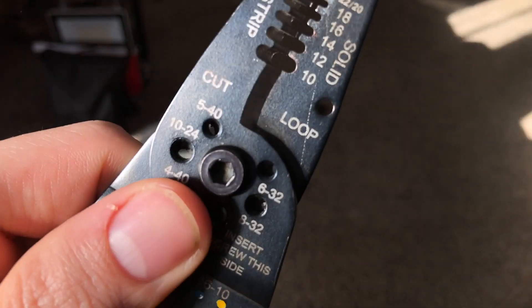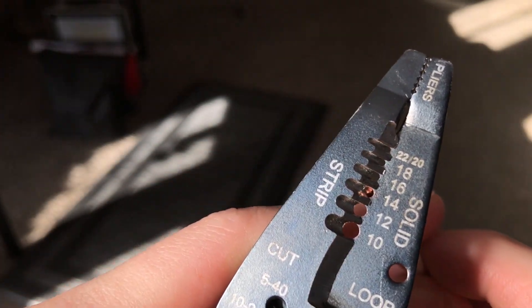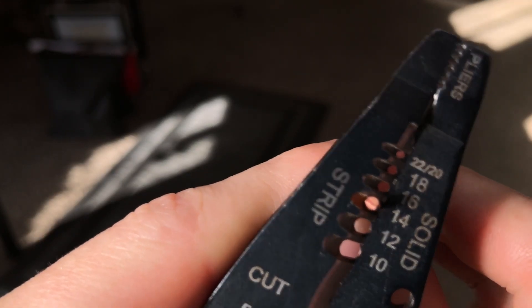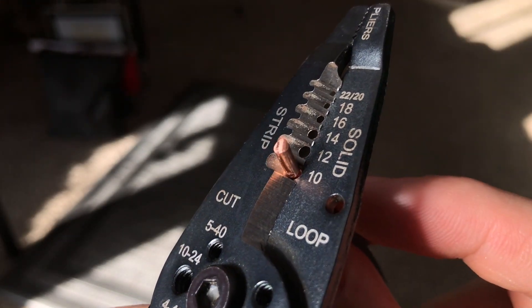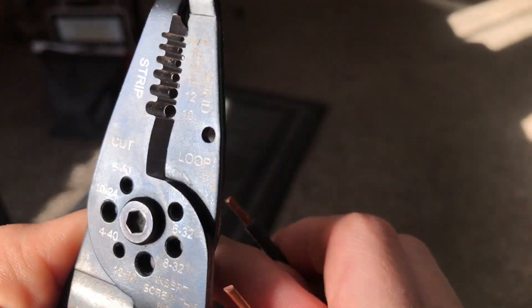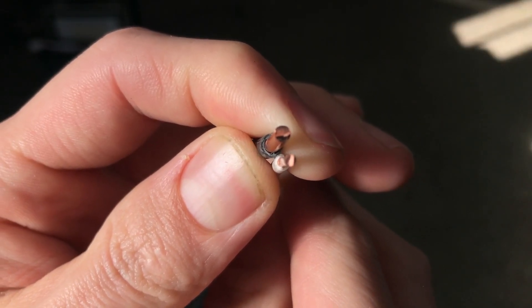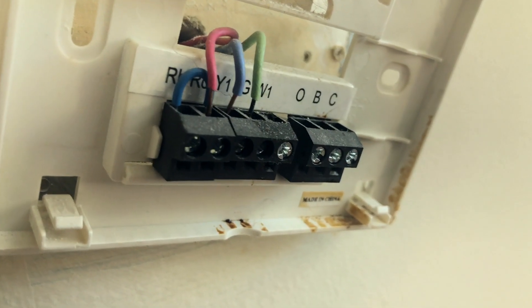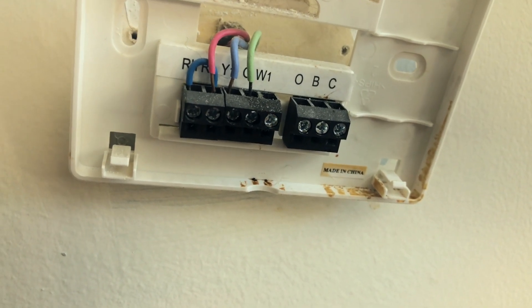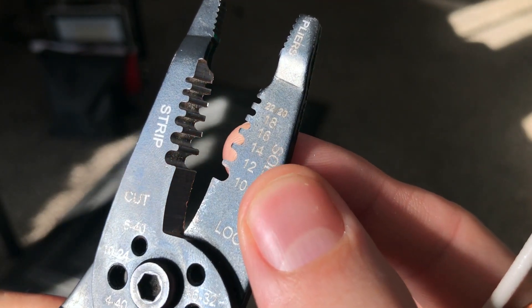You can check the voltage with a voltage meter. If you don't have one, here's what you're going to have to do. Grab a wire stripper — we're basically going to have to figure out the gauge of the wire. Gauge is a measure of diameter. A high voltage 120 volt system is going to be run on 14 gauge wire, and a 240 volt system should have been run on 10 gauge. We're going to take our wire stripper and measure the diameter of the wire — what you're measuring is the actual diameter of the bare copper, not the sheathing that goes around it. If your wires are 14, 12, or 10 gauge, those wires are too thick and you have a high voltage system — Nest is not going to work. What you're looking for is much smaller gauge wires, like 20 gauge or maybe an 18 gauge. That means you have a 24 volt system and Nest is going to work.